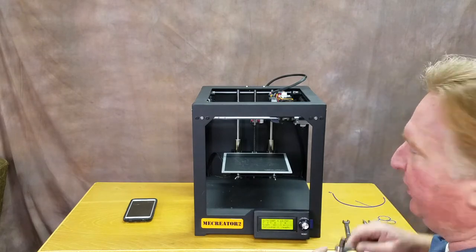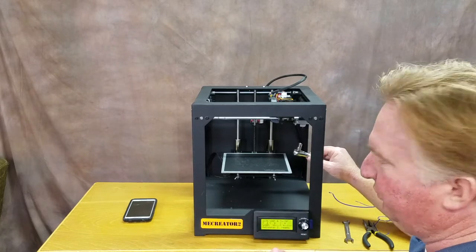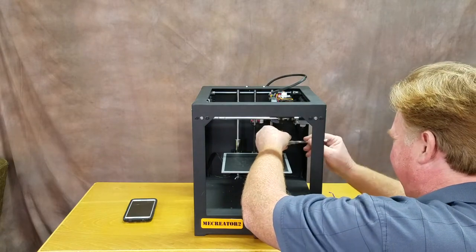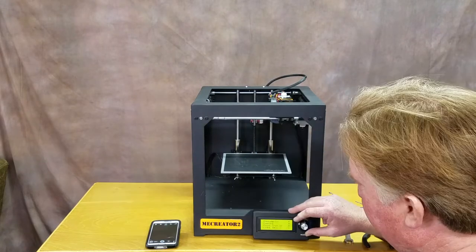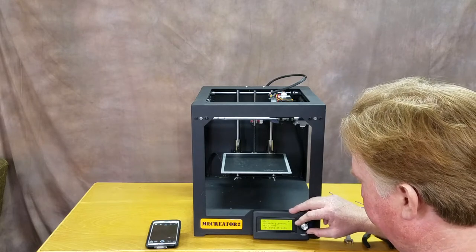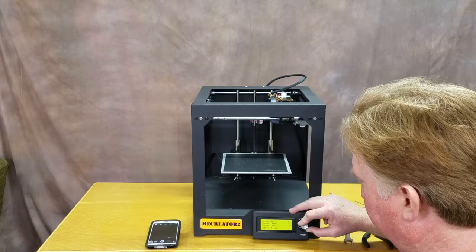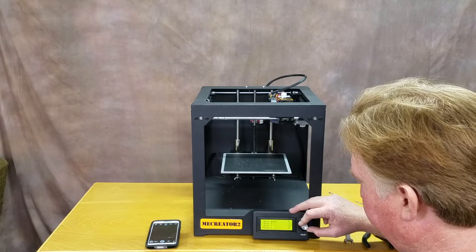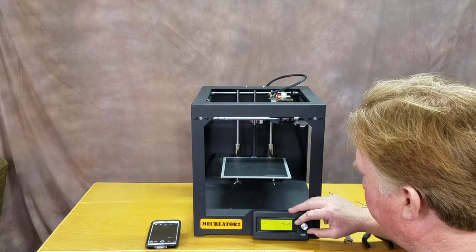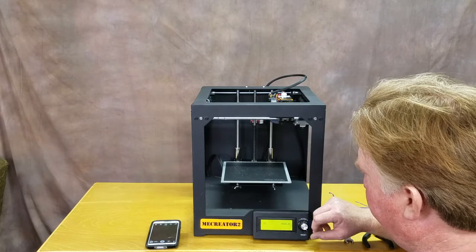What I'm hoping for is that I can pull out the nozzle and just pull the Teflon tube out — that's what I'm hoping for. I'm pretty sure that's not what's going to happen, but I can keep my hopes up. Now I'm going to go ahead and drop down the print bed a little bit. I'll move the axis, move it by one millimeter on the Z, take it down and give me as much room as I can possibly get. That should be plenty right there.